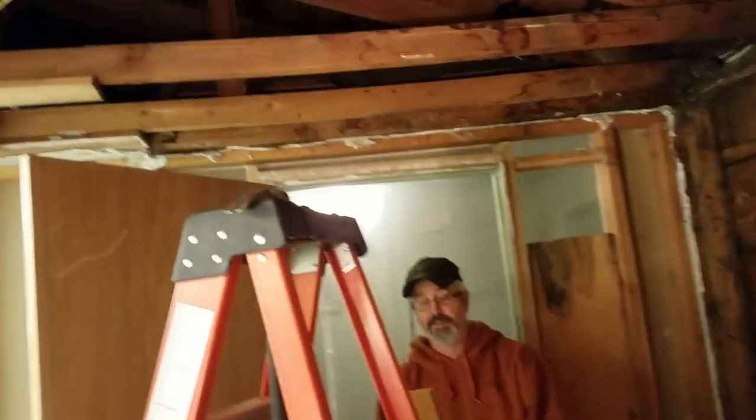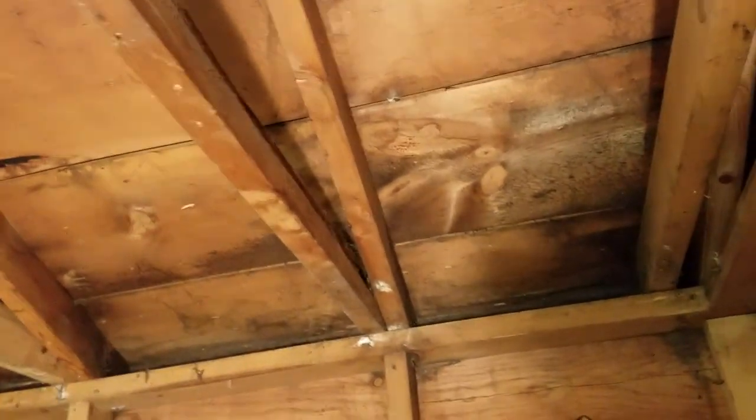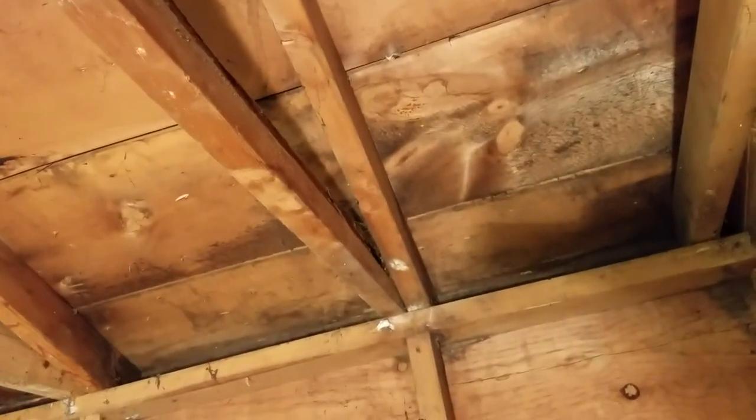It's been there forever, so obviously it helped. But we're reinforcing it. We're going to put another 2x4 alongside that old 2x4. We just got through doing that one, which took quite a while. The roof had come down some, so I had to get that in there, trimming and whatnot. And put a 2x4 right along here, and then there's where the truss goes down.